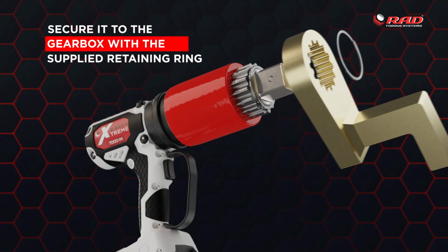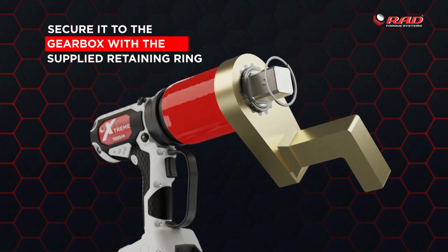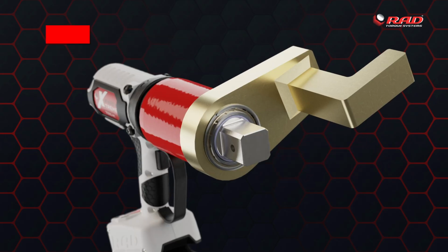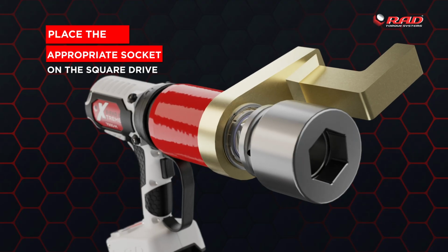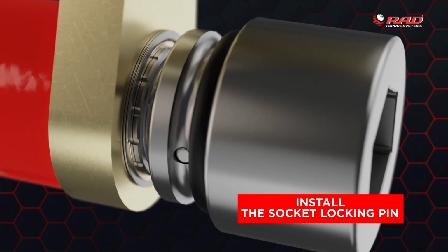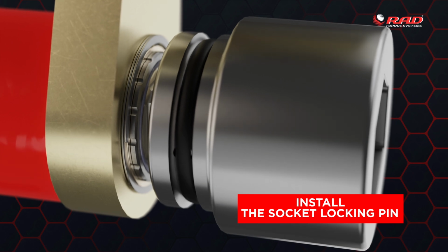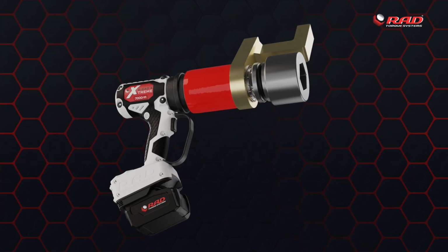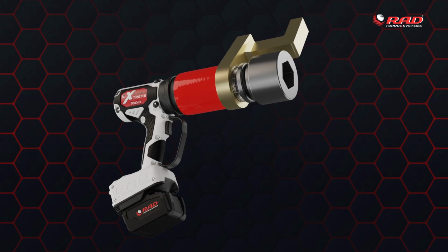4. With the reaction arm firmly in place, secure it to the gearbox with the supplied retaining ring. 5. Place the appropriate socket on the square drive. 6. Install the socket locking pin and set the O-ring to keep it in place. You are now ready to start using the RAD Torque wrench with the reaction arm.